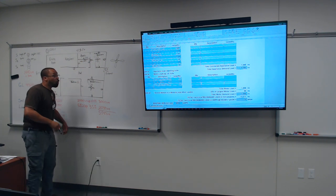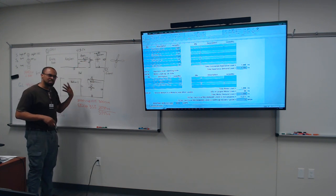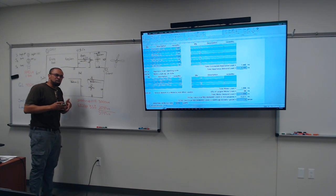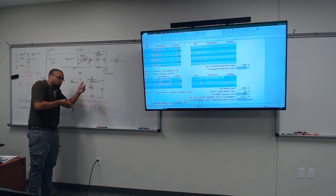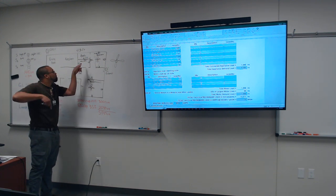You can do that, or if you got a lot of money, you can put another GFCI plug in there, because GFCIs are pricey, $27. You wanna go to the most economically feasible route when you start. So yes, you can put a regular plug that costs about $7, or you can put another GFCI plug, but that $7 plug, you can basically make it be protected by that main GFCI plug.